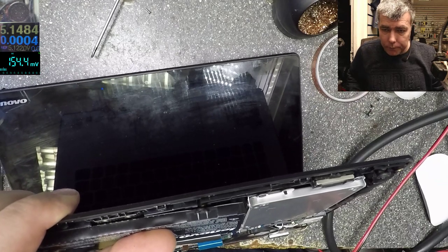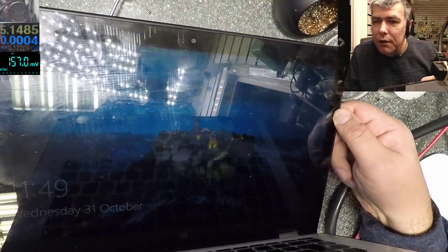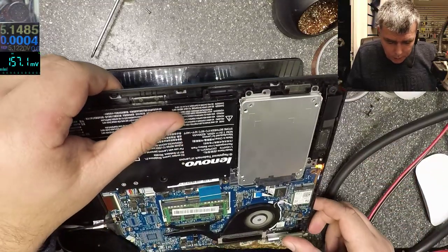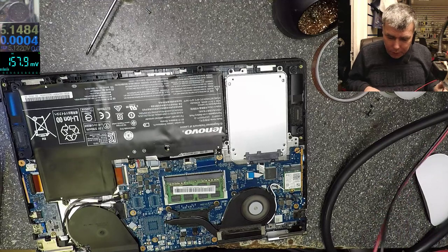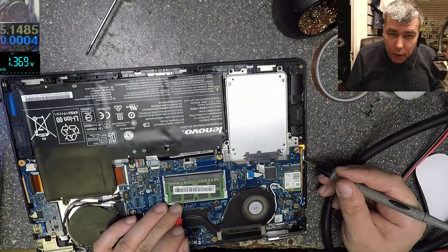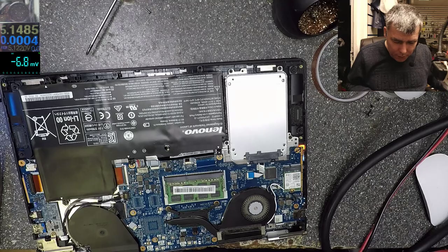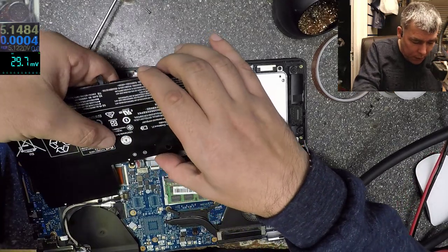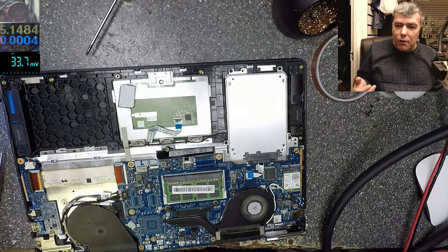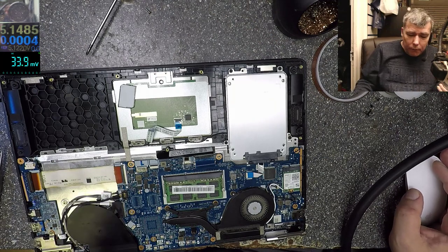And let's see, it's starting. Yeah, it's okay, it's on. I think you will see the image flashing because of the refresh rate, but trust me, it's not flashing there. Let's check the RAM voltage, but probably the computer will go to sleep. RAM voltage 1.36. Yeah, you can see that on the screen. So everything is working fine. So the issue was the chip itself. Okay. So I just try to give you an idea of the things to be checked when you have a laptop that turns on but no picture, like the RAM power supply.